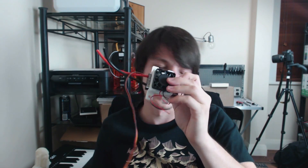So that will mount down to the chassis, and I can plug this 12-volt fan into — I could probably stick it straight into a four-cell LiPo to be honest, 14.4 volts. It's a combat robot, it's not designed to last forever. Or I could just stick a resistor in line. I quite like the look of that. The thing about the fan is it's kind of blocked off on some of its travels, so some of the airflow will be restricted. With that in mind it might be worthwhile modifying this file further to allow some clearance for those blades to suck air in from some gaps. Iterative design — this is not the end of this design, there will be more videos.